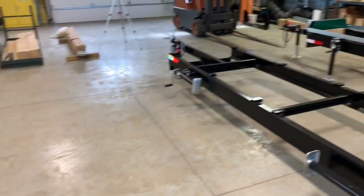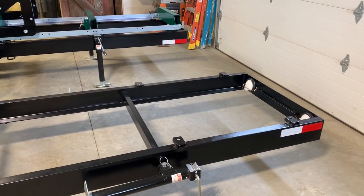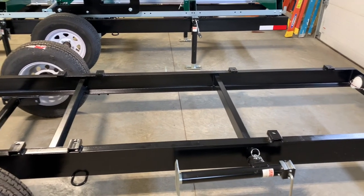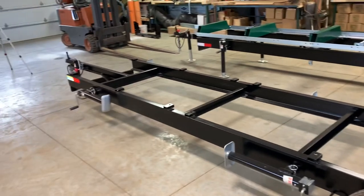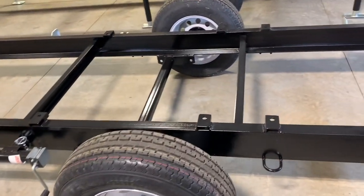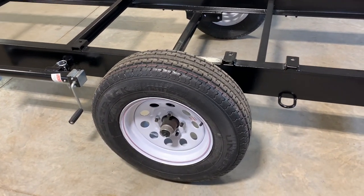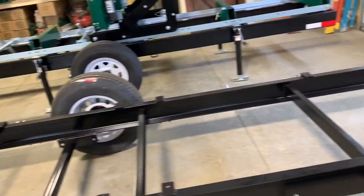We'll go over the trailer here. I have about 50 of these made a year — this isn't a promo for selling the trailers; Woodland Mills makes a good trailer themselves. These are road-ready and available for my local customers because we can't ship them. They come with three jacks down each side, six total, plus a tongue jack — seven jacks total. They're made from one-piece six-inch channel. All the tabs are already on so all the bolt holes in the track line right up, and I provide the nuts and bolts. Fourteen-inch radial tires, ST-205 75R14, greasable bearings, four-pin light connector, and a two-inch ball.